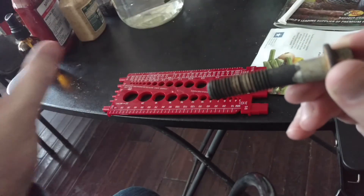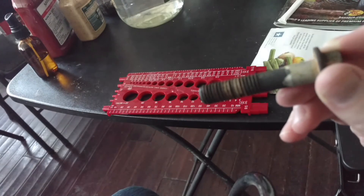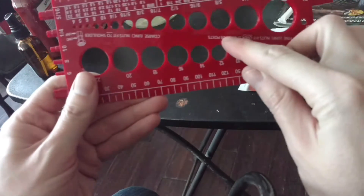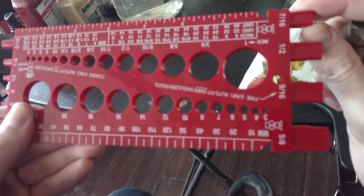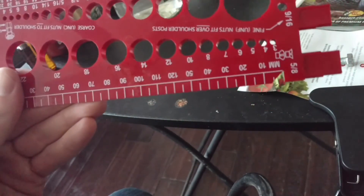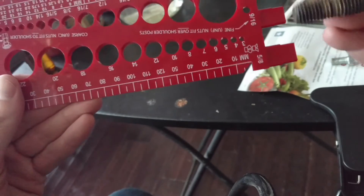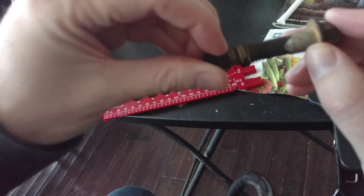Those three numbers are how you would see it when ordering: 12 by 60 millimeters by 1.75 thread size. They also have some things on here for shoulder bolts and also for nuts right here. That gets kind of self-explanatory — you just put it over the right one. Shoulder bolts are measured a little differently: you don't measure the threads, you just measure the shank. A shoulder bolt will have just a little bit of thread at the end — you measure from underneath where it starts to the end of the shank to get that size.